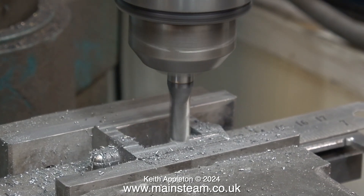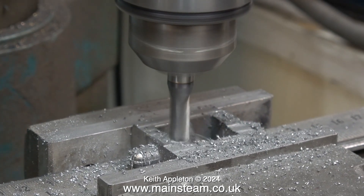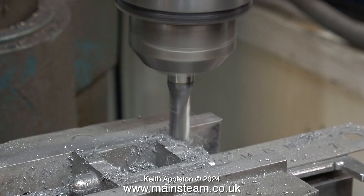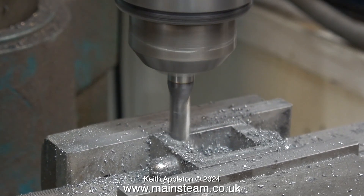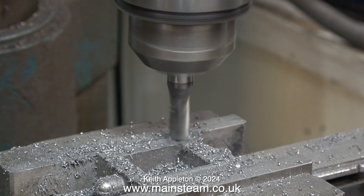This is a slightly deeper cut, so I'm observing the normal protocol, which is always to cut in the direction that the cutter is rotating so that the work is against the direction of rotation. I'm not taking very deep cuts anyway, and I've just gone back the wrong way as you've just seen — but normally you need to go in the direction that the cutter is cutting.